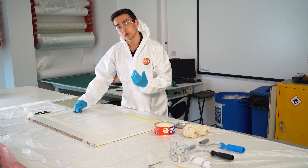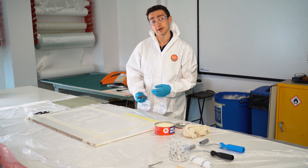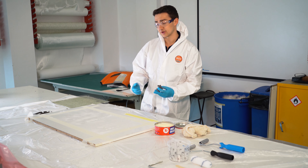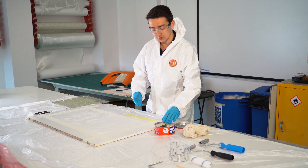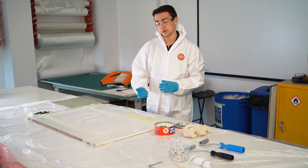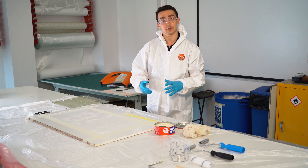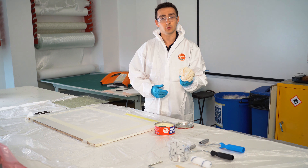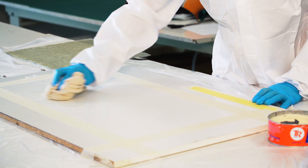Applying wax on complex moulds, we normally want to apply between three and four layers. On something basic like this, we can get away with one layer — you might want to do two if it hasn't been used in a while. That's just going to guarantee that once we're done with our panel, we can pick it up and it will release properly. Now that we've applied our wax, we want to make sure that we leave it for about 20 minutes. Some manufacturers will say 30 to 40 minutes, but 20 minutes is plenty of time for that wax to soak in. Once it's soaked in, we then use a clean merino wipe or a microfiber cloth and gently just take the wax back off.